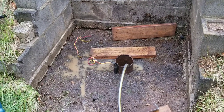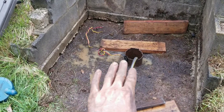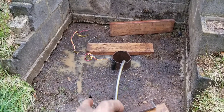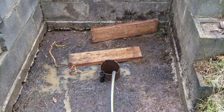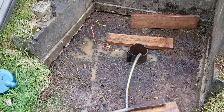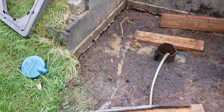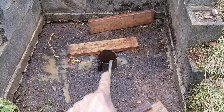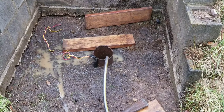You have to turn the air off real gradually to give it time for the water column to drop back down, while keeping the air pressure in the hose greater than the pressure of the water coming back down. Because if you just turn it on and back off again, it pushes all that sediment up in the hose, it clogs up. That's what happened to me — I turned it on, it went, then stopped. I turned it off because I had a feeling it was clogged, but I didn't know why. I thought I had jammed it down into the sediment too far, but no — it was the back-filling of the hose that did it.